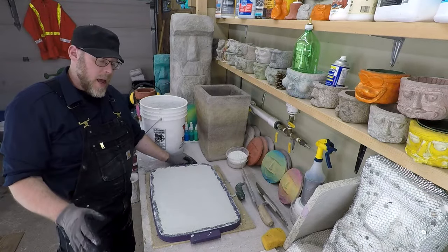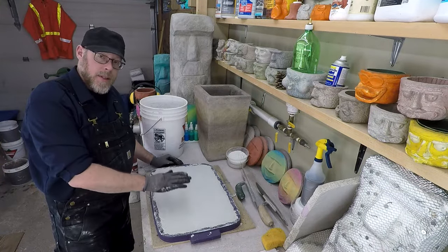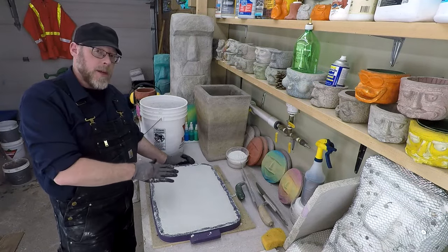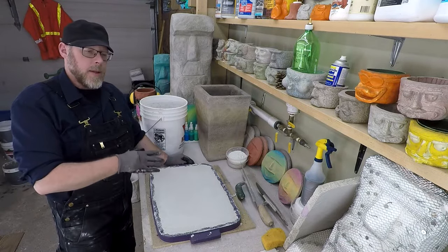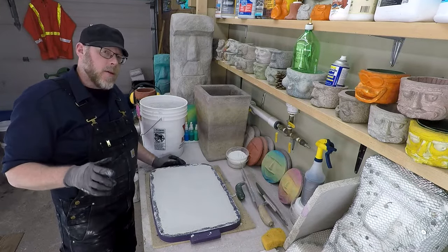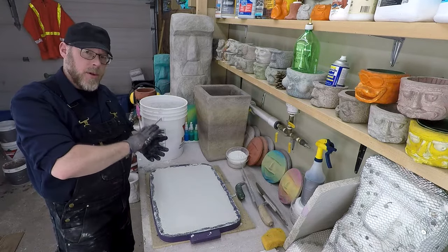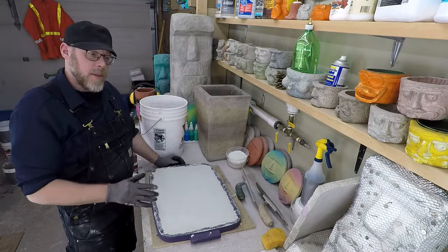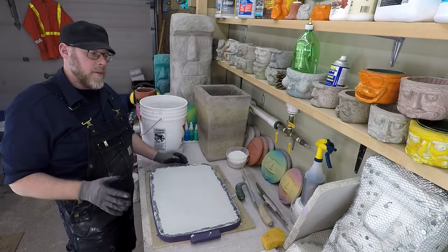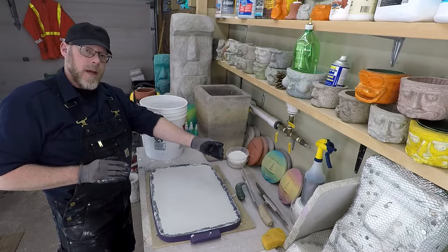The concern with covering fresh concrete is that if the plastic is left to touch the concrete, it could leave an impression if the concrete is fresh enough. More likely though, the concrete's already hard, so you're not worried about impressions, but it will still leave a discoloration because of the difference in hydration — you'll hold moisture at the surface where the concrete contacts the plastic, and you'll be able to see that in the final product. So if that's a concern, make sure you build a tent and a plastic dome over the top of it.